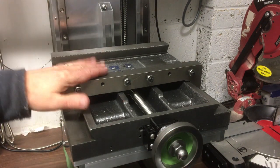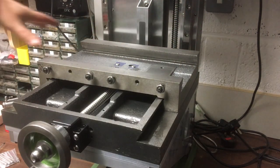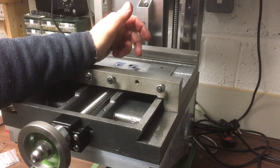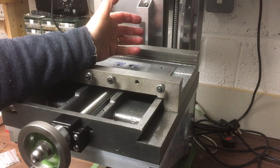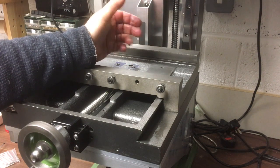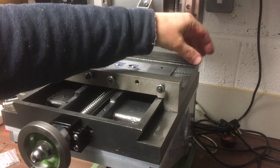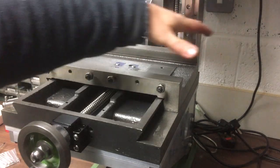So, onwards. In the next video, we need to have a look at the Y-axis on here. I've already made the little ball nut holder here, but the ball nut itself has got to be ground down on both sides. It's going to be a little bit interesting, but you know, nothing too complicated. It's just steps to go through. And then I've got to machine a custom end plate on the end here for the bearing holder. And then we can get that moving as well in here.